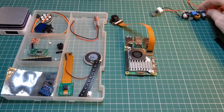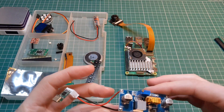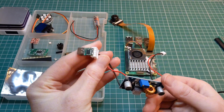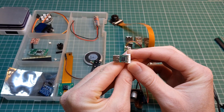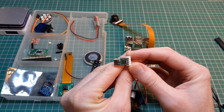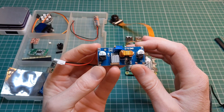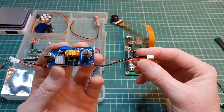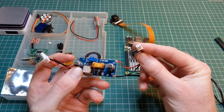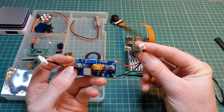One of the other elements I wanted to put in place was the ability to power the Raspberry Pi through any voltage up to 20 volts, so I have assembled a module here. This is a USB-C power delivery board that will accept any voltage via USB-C power delivery up to 20 volts and pass that directly to a DC-to-DC buck converter that brings it down to the 5.1 volts required. This output will be connected to the Raspberry Pi via the custom PCB.